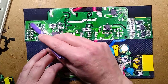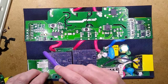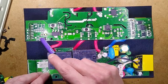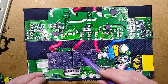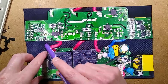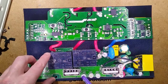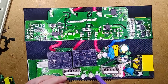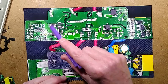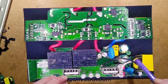The 5V from the voltage regulator feeds the circuitry, which monitors the switch inputs via this small connector and some resistors, plus a couple of decoupling capacitors for stability. There are two MOSFETs — 2N7002 — each with a 10k resistor pulling it down to 0V to keep it off, and a 1k resistor to turn it on. They have a back-EMF diode for each one. The two outer blue LEDs are switched on via resistors by the same transistor that switches the relay winding. The relays have 5V coils rated at about 10 or 15 amps depending on the standard.